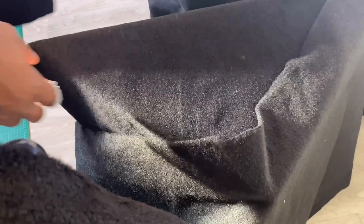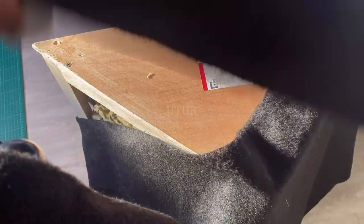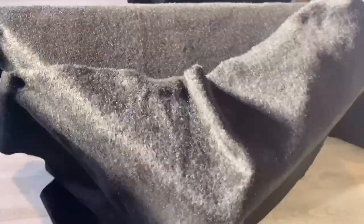The fabric is stretchy, so don't overly stretch it when sealing off the housing frame to avoid slack over time. For both the top and bottom bases, measure the length and breadth of the diagonally cut hardwood plywood, then cut a square from your fabric cloth — not a triangle — so that it covers the entire perimeter of the top and bottom base. I have replicated the process for all four base traps, ensuring the dampening fabric covers the base boards and the structure housing frames.